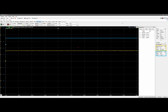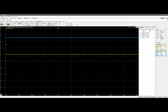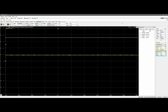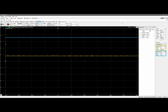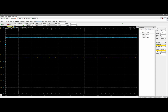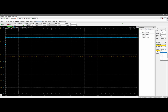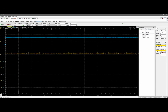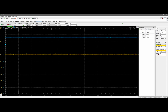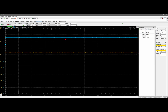My hands are not very warm, but we have a heater here to test with. Placing the thermistor next to the heater, we can see the lines come together. The blue line should actually be moving up more — a couple hundred millivolts per division. They should both be moving up, so there could be something with the wiring, but right now we're just demonstrating that it works. Putting this next to the heater, it does move up. We can even change to 100 millivolts per division to see more movement. Placing it next to the heater again, it goes up fast, showing how the circuit works.